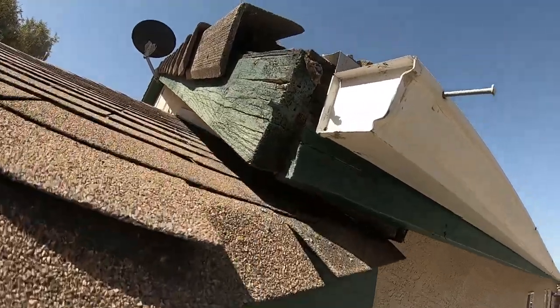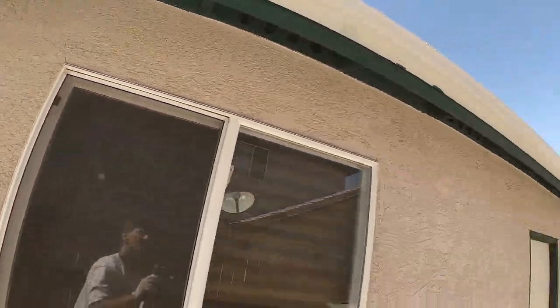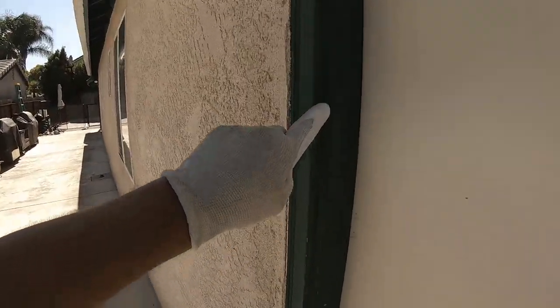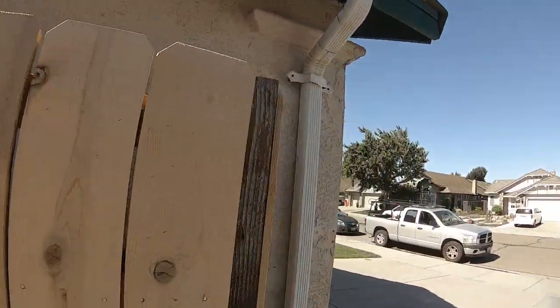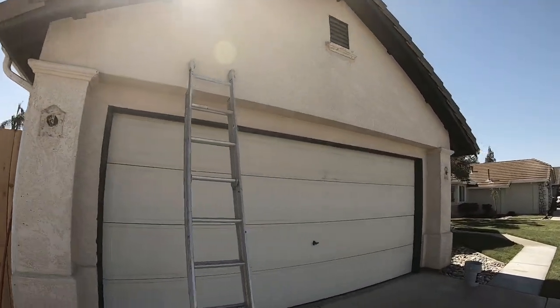Here we're gonna have to do some sanding - as you can tell there's a little bit of mold. We'll go ahead and caulk that in too. This is the type of crack I was explaining earlier - that's a crack where I can use the material I'm going to show you guys. Everything today is going to get sanded down and we'll caulk in all of these cracks. If this was siding you don't really want to do too much caulking because the siding needs to move and swell with the material - it needs to breathe. Let's get after it.